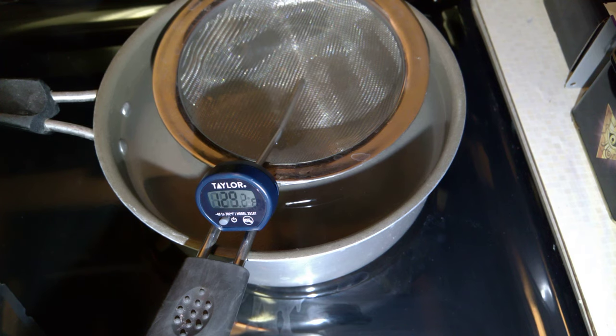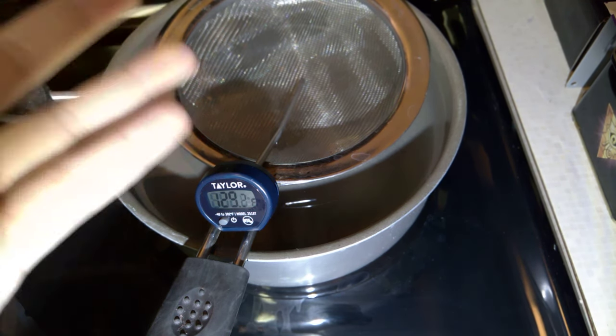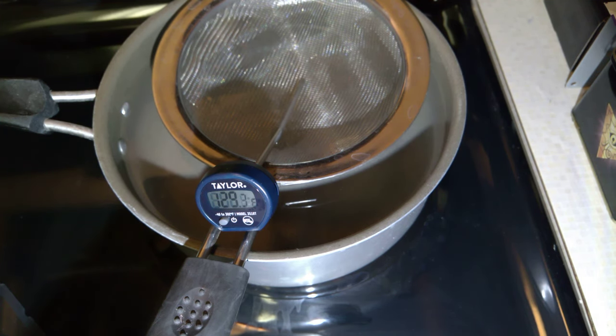Now, I did a little bit of research. I looked up deformation points. There's another term, RIT, or RTI or something. I forget exactly what it stands for. Either way, there's something called the continuous surface temperature of plastic, which apparently for ABS is anywhere from 65 degrees Celsius to about 85 degrees Celsius. That's the max temperature you can have it at before the chemical composition, the molecular composition, starts degrading. So in this case, we don't want to get the water too hot because the plastic will soften, but the higher the temperature is, the better this will work.